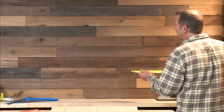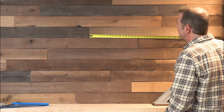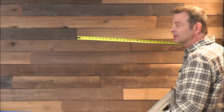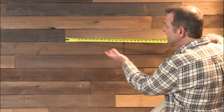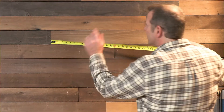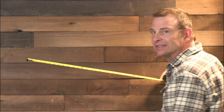Proper measurements expect that you're not babysitting the hook — meaning you're not standing at the hook end while using it. What can happen is the hook gets stuck in something, which is a great opportunity to ruin a tape measure. If your hook is stuck somewhere, don't pull on the tape. Come back to the hook and remove it so it stays intact.